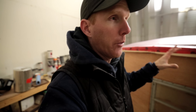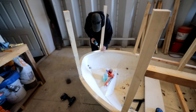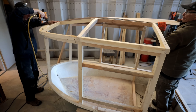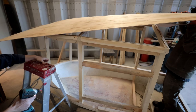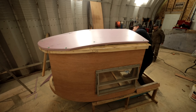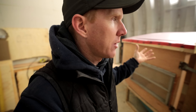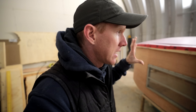If you're just joining us, I'll give you a quick recap. We started off with a tiny houseboat — the world's smallest houseboat. We framed it up with scrap 2x2s, skinned it with Luan underlayment, put a roof on it, added styrofoam insulation, and popped a couple of holes for windows. We tested it on the water and it was pretty well balanced. We've rethought a couple of things and adjusted our plan slightly, because the main priority is that it floats and doesn't tip over.